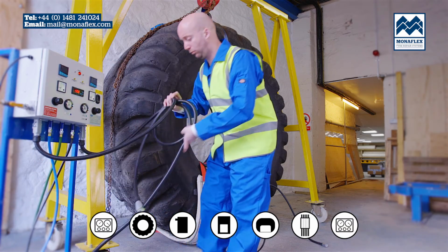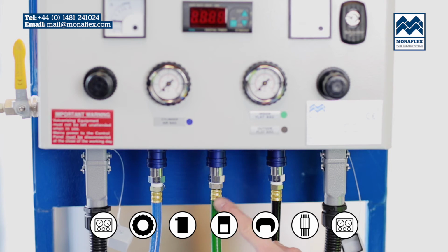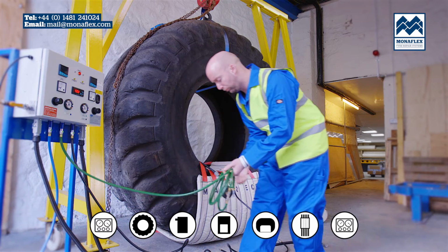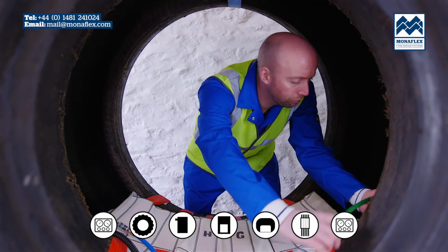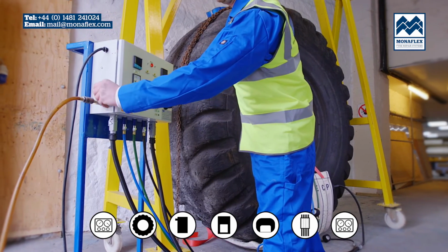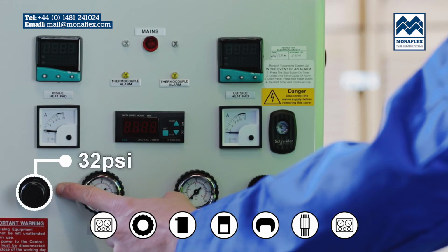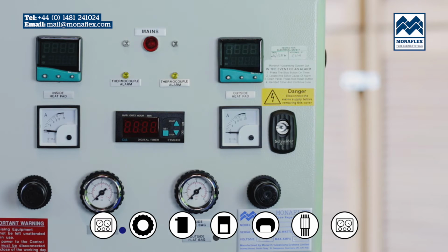Connect the heat pad and air supply lines to the control panel, blue for the cylinder airbag, green for the inside flat airbag, and black for the external curing pack. Prior to final inflation, perform a quick check that none of the electrical or air hose connections are trapped behind the components. With the incoming air tap open, use the black regulator knobs to adjust the pressure on the left gauge to 32 psi and the right to 28 psi. When in the correct position, lock the knobs off by pushing down to click.